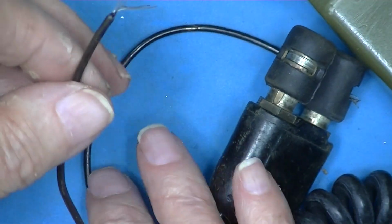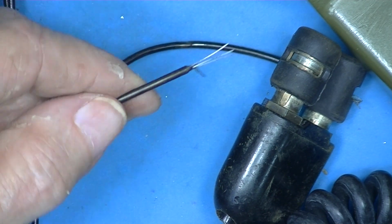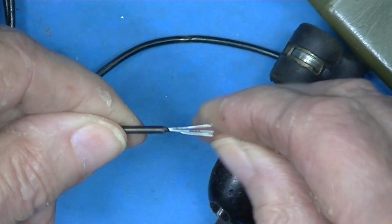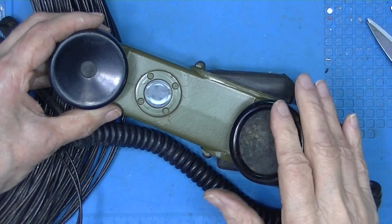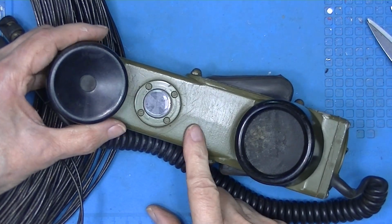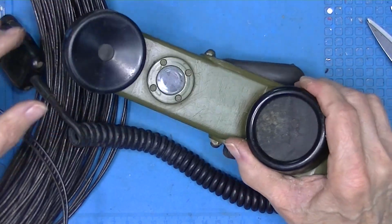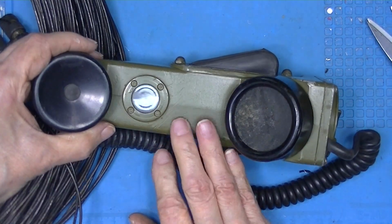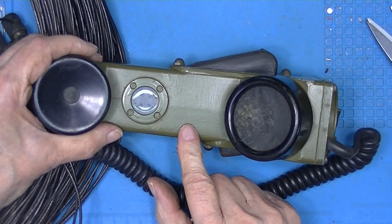1,000 feet of this wire, that would be 2,000 feet of wire, but one going 1,000 feet and one coming back, had a resistance of less than 50 ohms. The advantage of the TA-1, in addition to being waterproof and fitting well under the helmet, was that it did not take batteries. The disadvantage was using standard comm wire. Communication distances were limited to a 2-phone system to about 3 miles, depending on the condition of the splices.